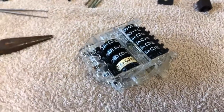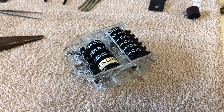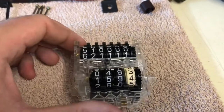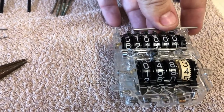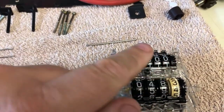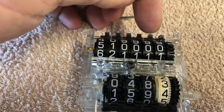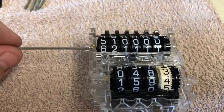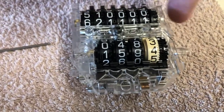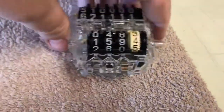That was definitely fiddly - it's the first time I've ever done that, but now that I've worked through the process I think I'd do it a lot easier next time. Basically what you need to do is get these rods through to about this distance so you can feed one big cog, one little cog, big cog, little cog, and so on. You start off with the little cog then do another little cog then a big cog, and slowly work your way through. I was lucky enough to have a spare piece to thread through the end to line it up, so when I pushed these pins through carefully on the edge of the bench it lined up perfectly and went straight through.